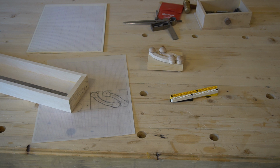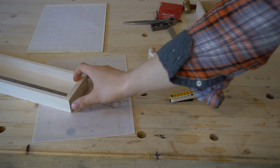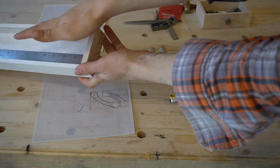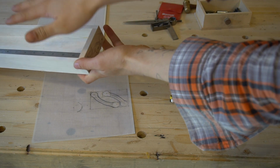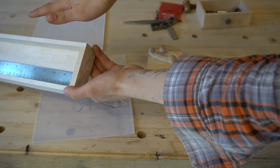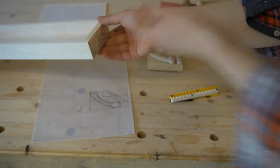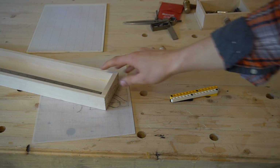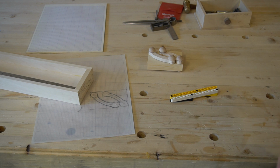Okay, so I'm actually at the hardest part now. I'm doing the hinges for the drawers, and since it's going to be kind of up here, I don't want it to just hinge down because then it would be very hard to reach into. So I want it to actually go out and then even tilt forwards to present what's inside. And there's a mechanism that's going to work great for that, and it's called a parallelogram. But the issue is that it's quite difficult to map it out on paper perfectly.